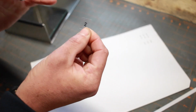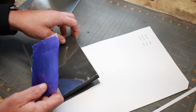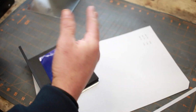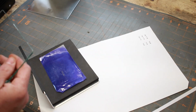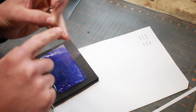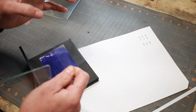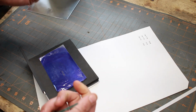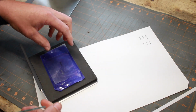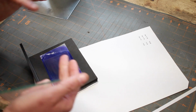And put that onto your transparency paper, and then in complete darkness, you'll take your undeveloped piece of stencil. You'll place it in the bottom tray of this stencil maker here. Stencil down first, there's no side that needs to be up, they're both the same. And you'll simply put your transparency paper on top. And what that's doing is creating a shadow. You're going to protect the light. So when you're printing, another important setting is that you want to print black. You don't want grayscale, you want it to be as dark as possible. And all you'll do is set it down on top of your stencil material, and set it down in the way that you can read it correctly. It doesn't have to be upside down or backwards or any crazy stuff like that.